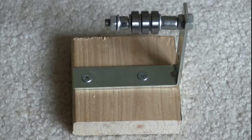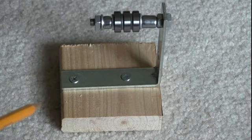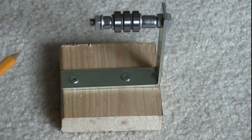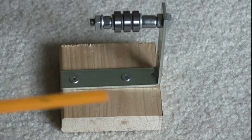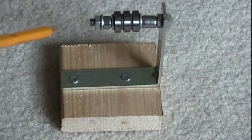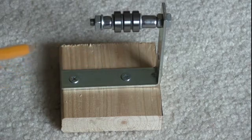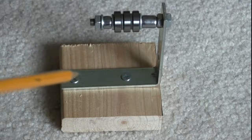The measurement of this piece of wood in order to fit on the scale is three inches by three inches. The purpose of the bearings is that when you put the rod on this little device, it tends to pull the fixture that holds the rod on top of the scale, shifting it back and forth and disturbing the reading. So it's best to use roller bearings or ball bearings, and still you need to take extreme care to make sure it's not pulled sideways when you mount that rod for an accurate measurement.